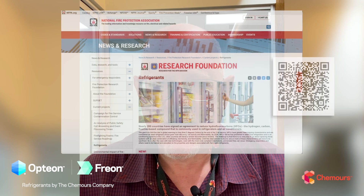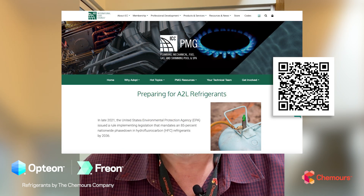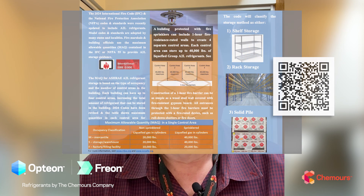I'll refer you to a couple of references: material from the National Fire Protection Agency (NFPA), the IFC, the International Code Council, and the AHRI Safe Transition Task Force, which has put together some infographics. It basically depends on how much gas you need to store and the maximum allowable quantity (MAQ), which varies based on your storage type — shelves, racks, or solid piles — the occupancy type, whether there are sprinklers, and how many fire compartments or control zones are in the facility. It's pretty easy to figure out where you fall, and we'll put the references below to guide you.